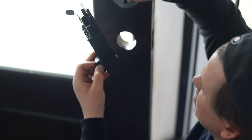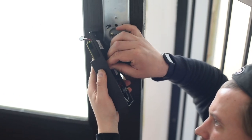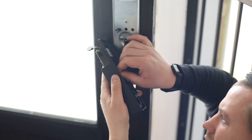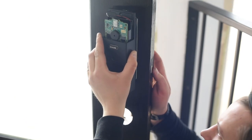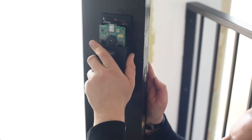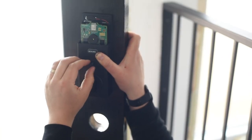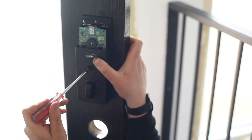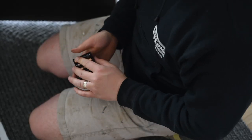Once that's done, you get to install the alarm assembly. Pull off the battery cover before installing it. From here, connect the cable into your alarm assembly — there's only one way the cable will connect, so line it up using the colored dot. Then install the alarm assembly: there is a tab to line up and a channel for the cable so it doesn't get in the way. Make sure to align everything before moving on. Take the long screw included and attach your alarm assembly to your door, then go ahead and install your batteries.